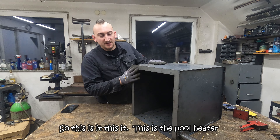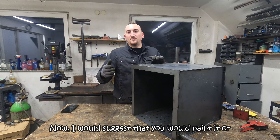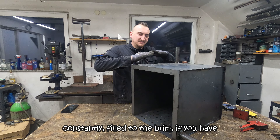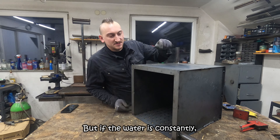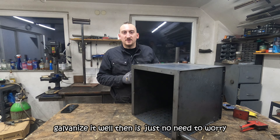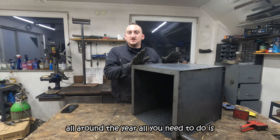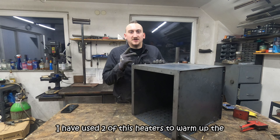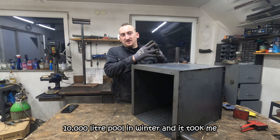This is it — the pool heater, the finished product. I would suggest that you paint it or galvanize it to prevent rust. If your heater is not going to be constantly filled to the brim, air and water mixture might cause rust. But if the water is constantly filled to the brim it won't rust, or if you galvanize it there's no need to worry about rust at all. You can have it hooked up all year around — just disconnect it in winter so it doesn't freeze, expand, and explode.